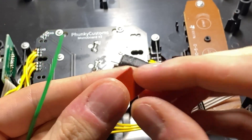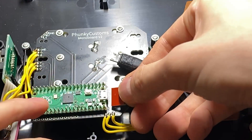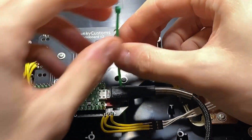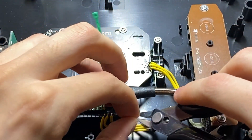So it comes with this little piece of foam tape, and you actually use this to provide support for the USB cable as it goes into the connector. You peel the backing off and you put it on, and then you use the included zip tie to secure it in. You might want to put this on while the PCB is unscrewed from the guitar so you don't have to use tweezers like I do.